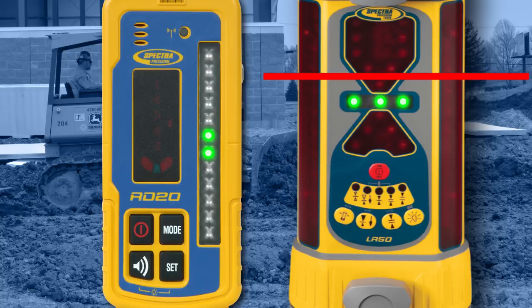The RD20 on-grade match LED will transition to a continuous double blink indicating an offset is being used. To return to the receiver's center on-grade location, press the mode button to illuminate the set on-grade match LED, then press and hold the set button for 4 seconds. Another way to return to the center on-grade location is to cycle power on the RD20.